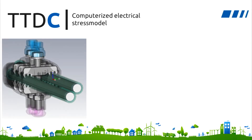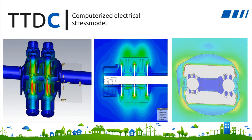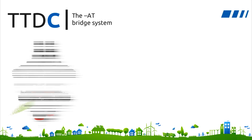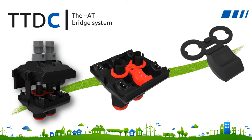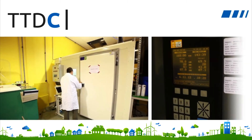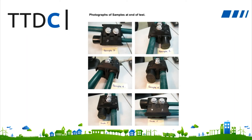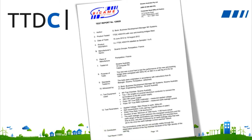Thanks to a thorough electrical potential computerized model, we've been able to analyze the level of electrical stress on millions of points within and around the connector while it is operating. This led us to develop a truly original, patent-pending solution to funnel the electrical stress within the connector. We designed a special semi-conductive bridge that limits the floating potential of all metallic parts, preventing any damage to the connector body. This has been validated with a very demanding test — salt spray under 35 kilovolts — making the TTDC AT the first fully protected, one-step installation connector to successfully pass a 1,000-hour salt spray chamber test under electrical tension at 35 kilovolts.